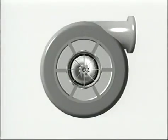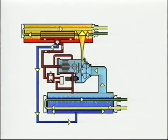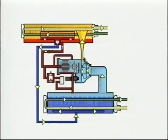Inlet guide vanes are used to control the capacity of the centrifugal compressor. These are movable vanes located in the suction opening. When they are turned fully open, the compressor produces its full cooling capacity. As they are closed, they reduce the amount of refrigerant flow through the compressor and thus reduce the capacity of the refrigeration cycle. The basic centrifugal refrigeration cycle operates much like the positive displacement compressor cycle, with some exceptions.